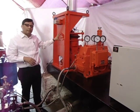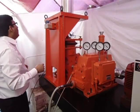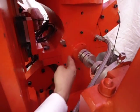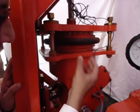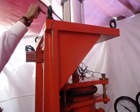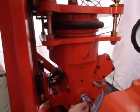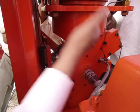As detailed, the bearing loading assembly is the most critical part. My colleague Mr. Rajinder Tripathi will join to demonstrate how this assembly works. The bearing loading assembly is built in two parts — a lower half and an upper half. The upper half completely opens up to reveal the test bearing assembly inside. The pneumatic cylinder on top moves the upper half up and down so the test bearing is available for inspection, change, and other tasks.